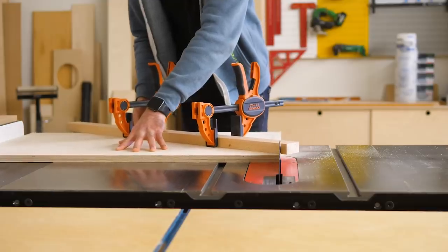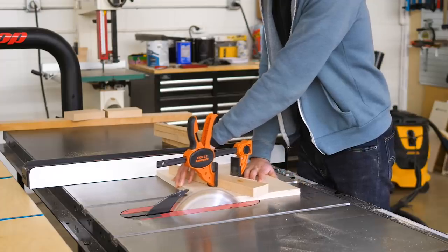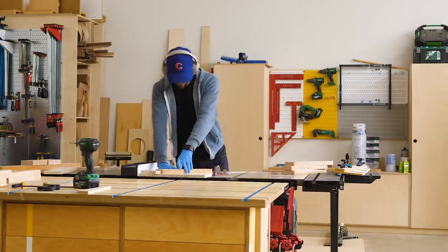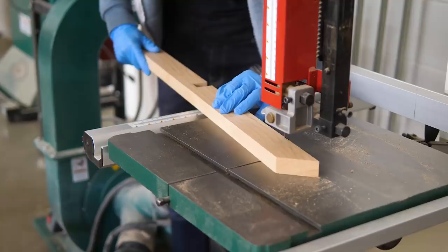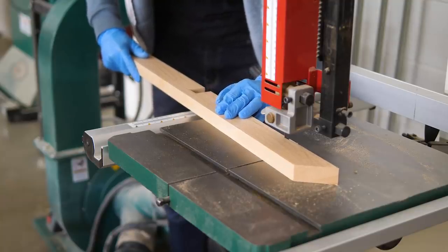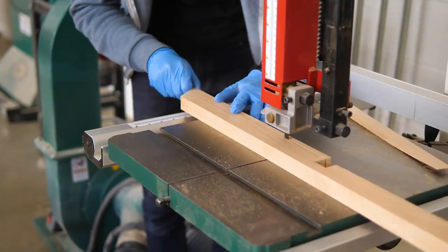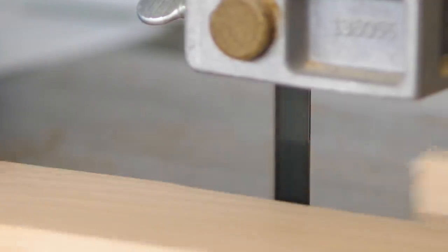After that I could repeat this cut to make miters on the other three ends of the stretcher piece, and then pretty much do the same thing to the leg pieces — only there I'd have to make cuts on both ends, for where the miter faces and for where the leg is going to hit the ground. With that out of the way, the rest of shaping the leg is mostly just aesthetic. The joints and mating faces and all the business ends are done, so next I took my stretcher piece over to the bandsaw and trimmed proud of the line, then used my template and a couple of flush trim bits to get the piece to its final shape.